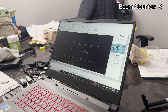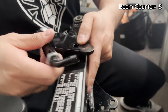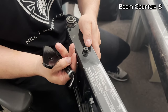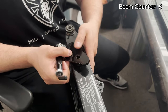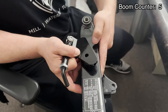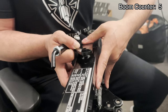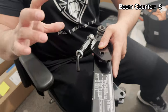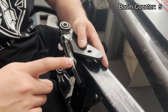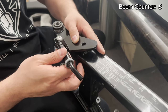So if we kind of mock this kickstand up on here, say it's going to be sitting like that — we don't want it rotating around and getting crazy. I'm going to put a little tab in the back end of this that will lock on the bottom side of the swing arm, so once you torque it down it should keep it from rotating. I'm also thinking about popping another hole in here, extending this up a little bit, adding through-holes so we can run a bolt all the way through with the back plate and sandwich the whole thing down. It's going to be super robust. Keep in mind the Grom is a lot taller than the Ruckus, so we have our extended version — which probably isn't long enough still — but it'll get us in the right direction and we can modify it once we've got the prototype mounted up.